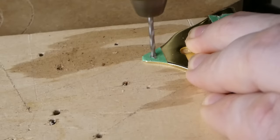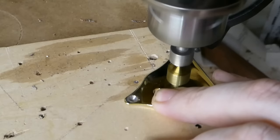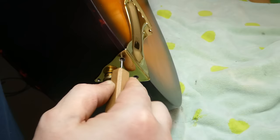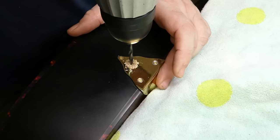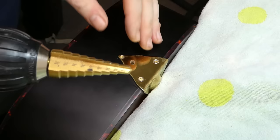As you might expect, this only looks like it's made of solid brass — it's really plated steel. My screws have flat heads, so I'm going to countersink. With the tailpiece back on, I'll mark the positions with an awl. I'll use the original screw hole to center a drill bit of the exact same diameter, so I know I'll be concentric.